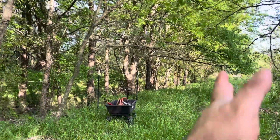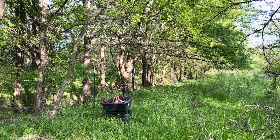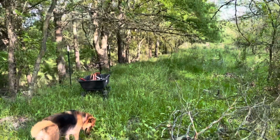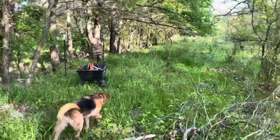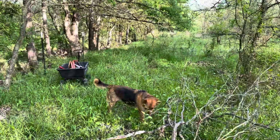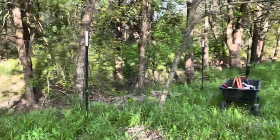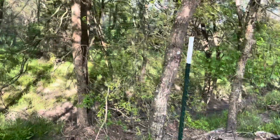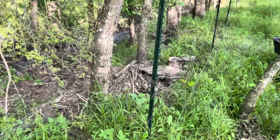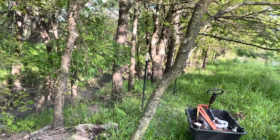There's a bend over there, so I'm just gonna take it like that. Make it tight on trees, make it tight on the T-post, and it's gonna have to work that way. I'll put a brace whenever I get a very good fence stretch. But this one, as it is, it's a little crooked. But the wire is very straight though, and very, very tight. So that's good. I've done this before, about 2 years ago, and the wire is still tight. See, this wire is tight. I made it tight. It was all loose in the ground. So it'll work like that.